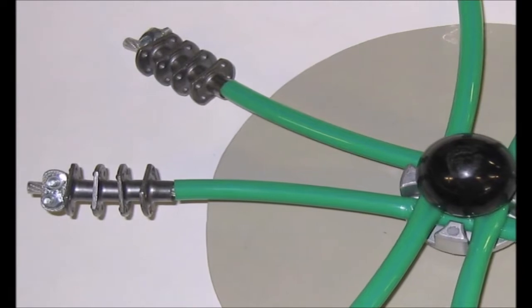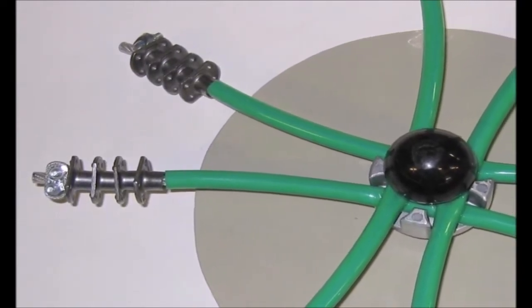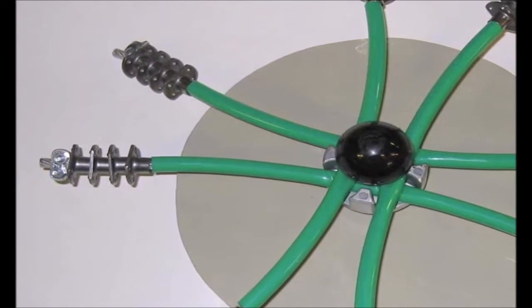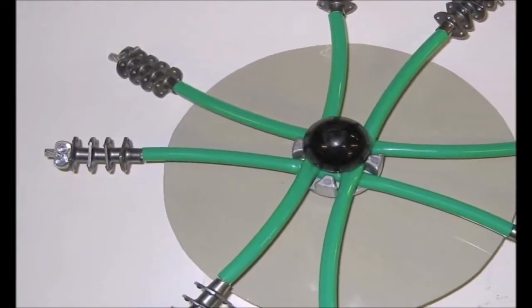Lifa machines are the only ones powerful enough to rotate such heavy brushes. The bristles, i.e. green arms, bend, so that the metal heads will both scratch the dirt and bang and tremble the sides of the duct. The length of these four arms is easily adjustable in order to find the optimum effect for the size of the duct and the type of dirt in question.